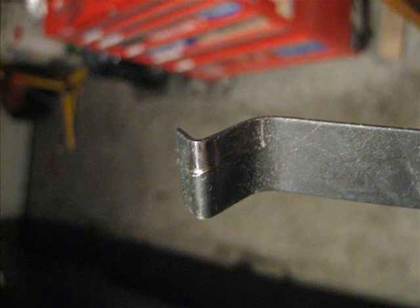Here is the offending piece. It is the cam locating spring found in gearboxes from 1971 to 1973 on the Triumph models. On the top, you can see the wear that causes false neutrals. When you shift into second or fourth, up or down shifting, you will notice that you think you're in gear X, but in real life, you're in neutral. Pop the clutch out, revs go up to 5,000-6,000 right quick.